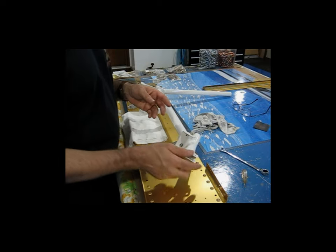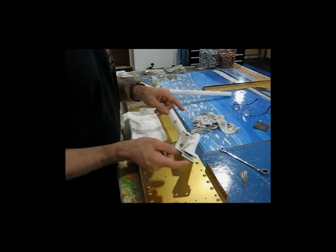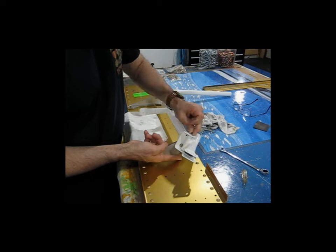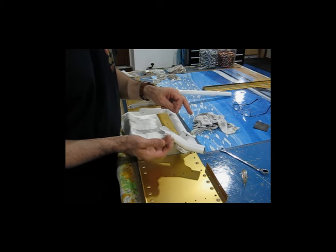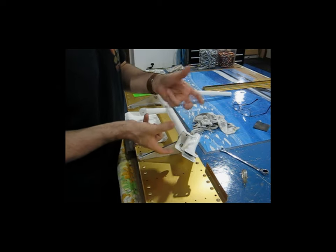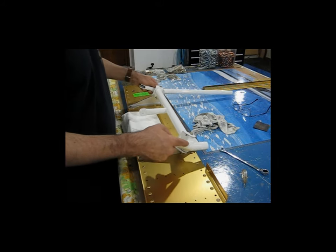Here's the end I was working on — I did take this back off and sanded one end down just a little bit to give it a little bit more clearance. When I did that, I was able to tighten it one full hole. Now this bolt is nice and tight — it won't turn on its own — and this rotates really freely now. There's virtually no play in here at all. Because I didn't change the length of the bushing, this pinched the bushing and it hardly moved at all, so this pivot point here did not get compromised. This moves really free now — so this is finished, and it's time to move on.